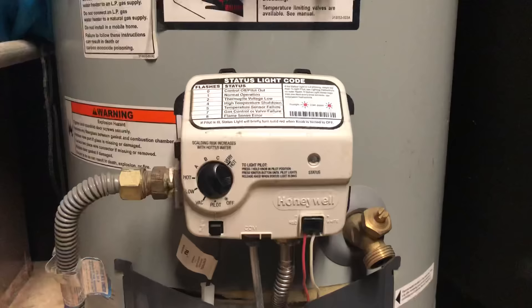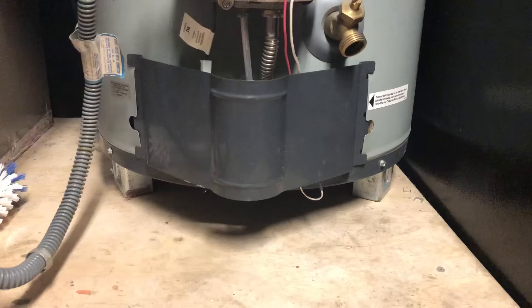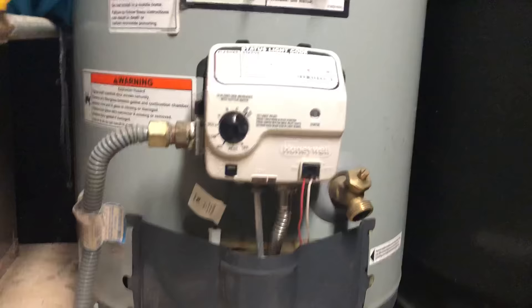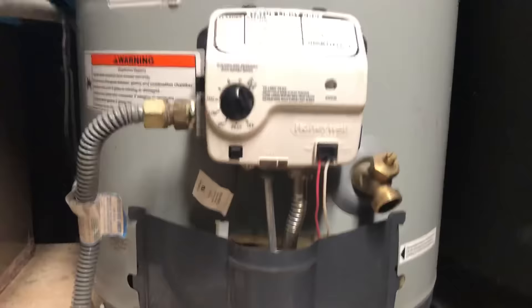If you look at the bottom of this water heater, the first thing we're going to check out is where our air goes into this system. In this model right here, the air intake is down here and it goes up through a filter grate. That's the first thing I'm going to have you check. If it does have a filter grate underneath there, you need to turn the system off, let it cool down, then get a brush like this and clean that filter grate.